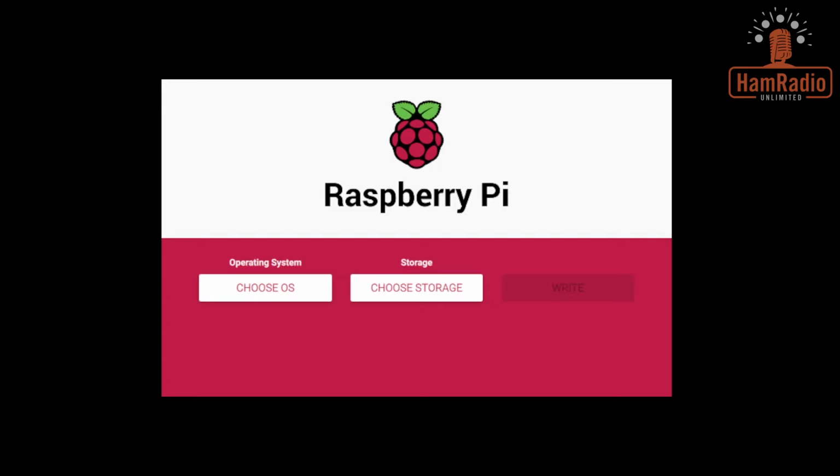All right, now that we've downloaded our image, we need to expand it. If you downloaded the XZ file and you're on a Mac, you can just double click on it and it will expand. If you're not on a Mac, you get to figure out what you can do to expand that file. And if you are on a PC and you downloaded the exe, you can double click on it and it will expand the file as well.